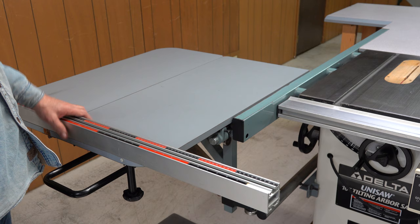And number 65 is attempt to keep your rollers clean. There's two rollers in here, one here and one in the front of the table. They're always opposite the other roller you can see. They're black inside and they have a V. And you'll find that there's probably some crushed dirt that's smashed onto those rollers and it doesn't operate smooth anymore. And if you listen, sometimes you can hear it as you move your table. You can hear how it's going round and round and hitting the thump, the thump, the thump on dirt. And if you clean that off, your table will work a lot nicer. Mine needs to be taken apart because these do have dirt inside, both top rollers.